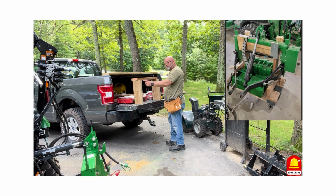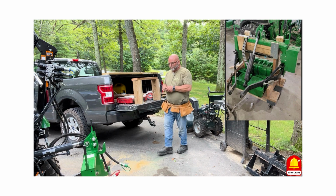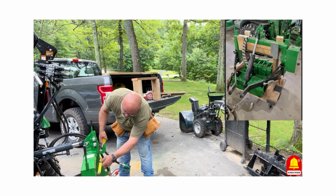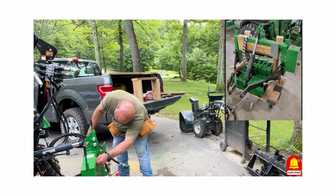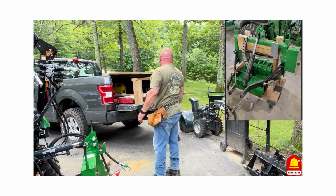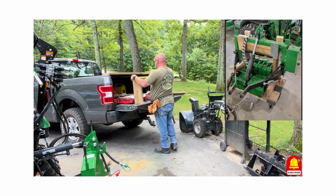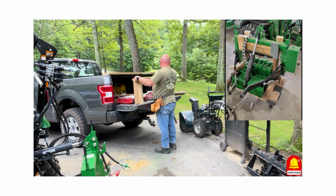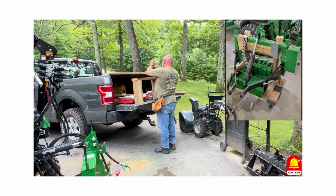So these are the uprights here. This is my cross piece. I'm going right at the outside edge. No, I'm not. Hold on, let's double check the width. There are gussets on this. So I want to be at 22.5. So I'm going to do 22. So I'm going to do 11 off center, which should be 24, so that's 12. And then minus 11 would be at 1 inch. So the outside edge is going to be at 1 inch on both sides.